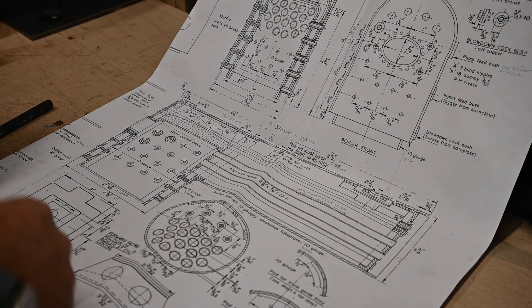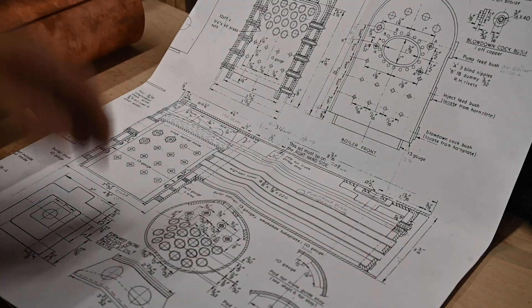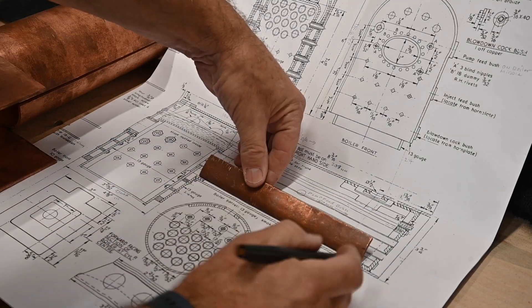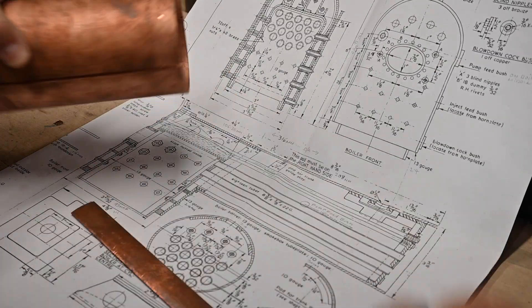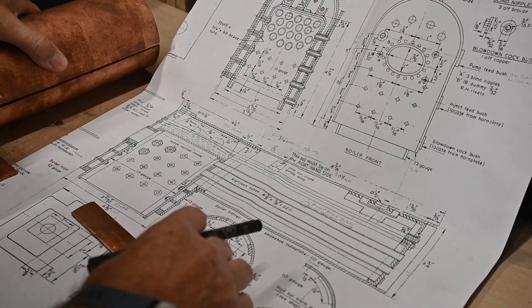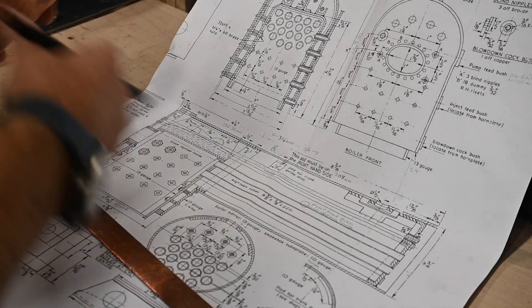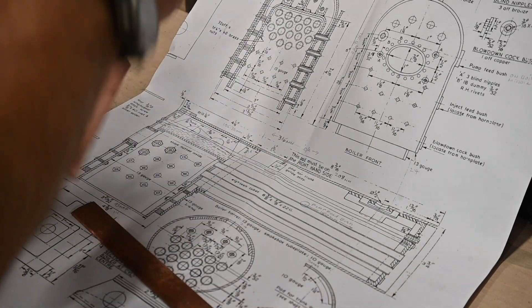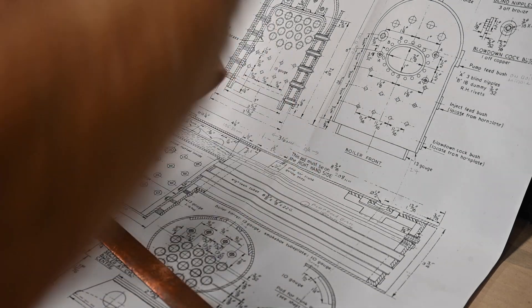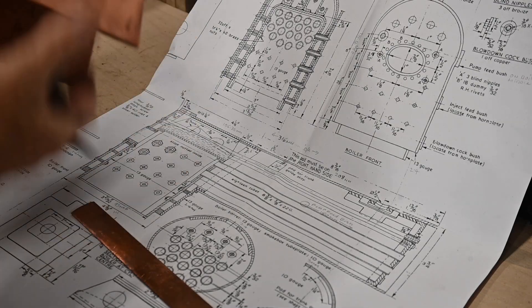What I've got to do is come in from the end, and the butt strip actually fits in there between the boiler tube end plate, which goes in there eventually. So I've got to allow enough room for that, because this boiler is designed around having a single copper tube with no obstruction. I couldn't buy a three-and-three-quarter copper tube — it's no longer available — so I had to roll my own. I wanted to roll my own anyway because it makes for a nice clean straight joint down the boiler. I have seen them where normally they'd be joined and they sort of kick off and don't look very nice.